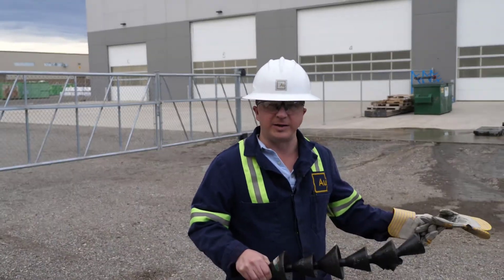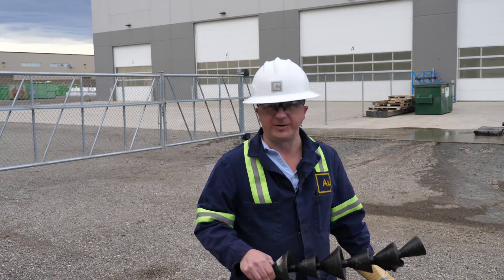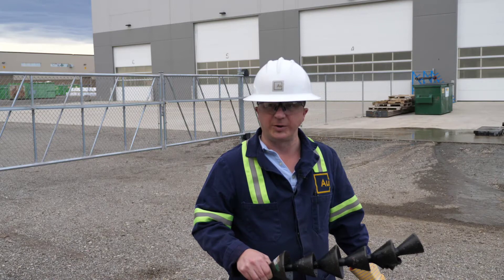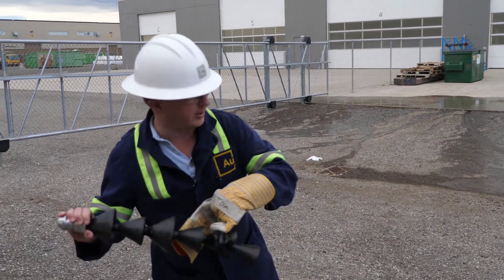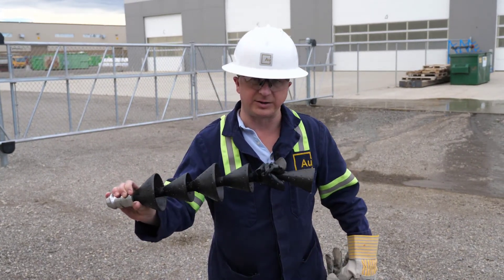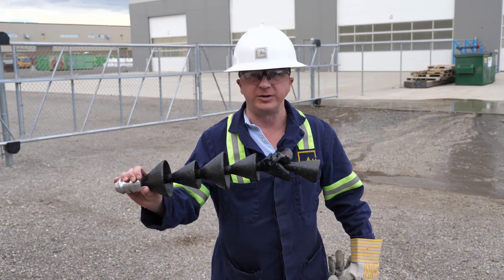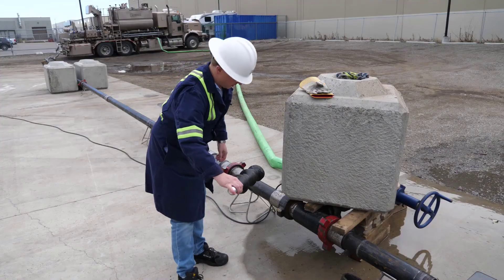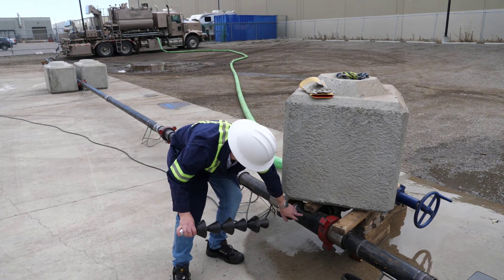Normally our sleeves would be pinned at around 2,000 PSI; for this case here we're at about 250 PSI, so there's hardly any concern of the sleeves opening. The damage on the wiper dart was actually caused by the dart getting pumped into the T on the way out. In the arrangement here, the damage was caused by the discharge of this T here.